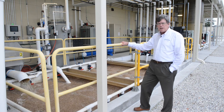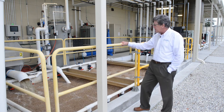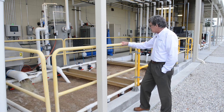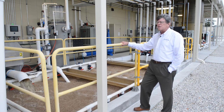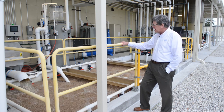So we're getting reduction of the ammonia — oxidation of the ammonia from ammonia to nitrite, and oxidation of the nitrite to nitrate in this process. Going through the two chambers finally to the pumping sump, it's oxygenated and pumped back to the tanks.